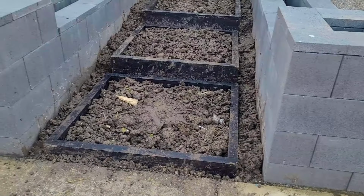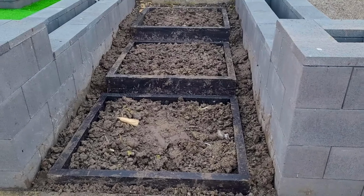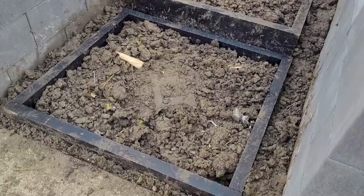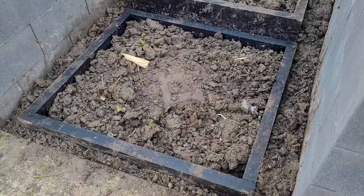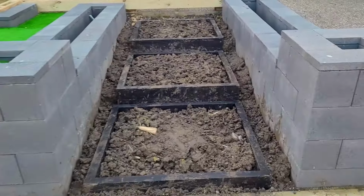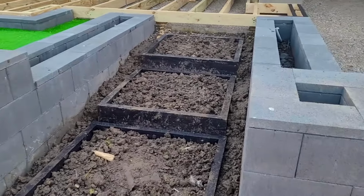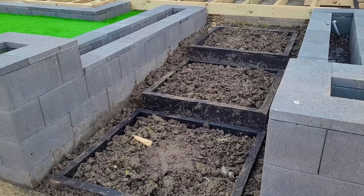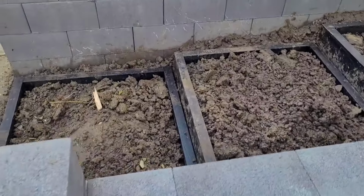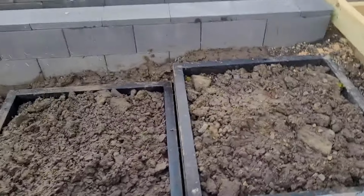Today is 21st of July, and I just prepared the footing for the deck steps. It was really tough working with the soil, but anyway, these footings are prepared now, and tomorrow, maybe the day after, if there is no rain, I will put the frame on this foundation. These foundations are ready, and I connected them with each other with screws.